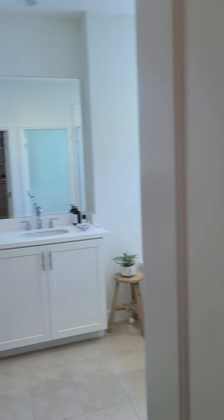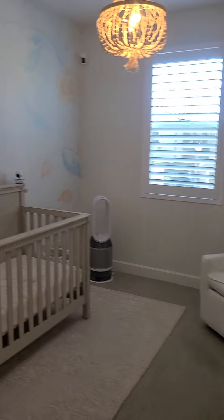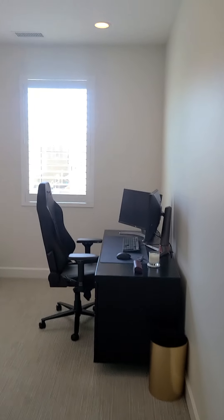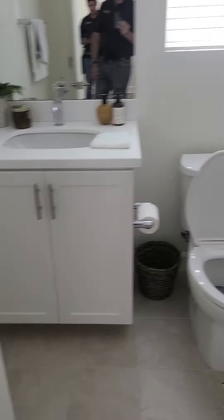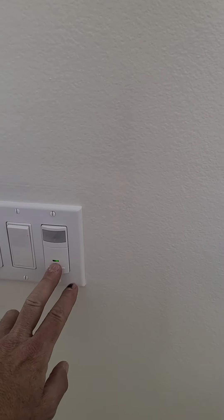Attic access is in the master bedroom closet — the attic looks super clean with no rodent activity. The attics and roof are ventilated with a pretty bulletproof vent that keeps rodents from getting in. Heading to the first upstairs bedroom — in good shape, outlets and windows are good. The bathroom is in good shape, no leaks under the sink, toilet is secure, humidity sensor switch for the fan and occupancy switch for the light fixture. Next bedroom: outlets and windows are in good shape, closet doors are good. The last hallway bathroom has the tub and shower in good shape, toilet secure, windows good, sinks in good shape — again with the humidity sensor fan switch and occupancy sensor for the light fixture.